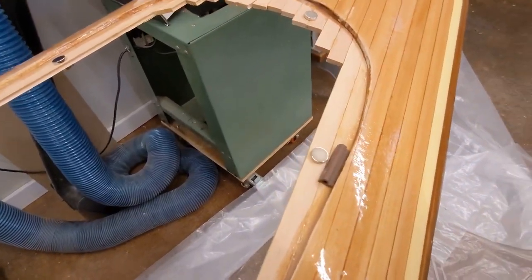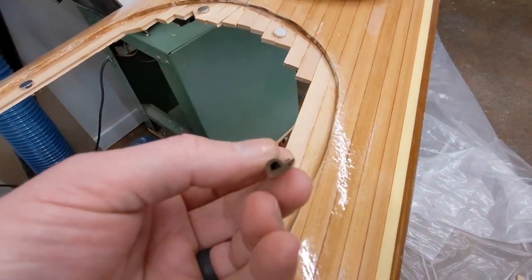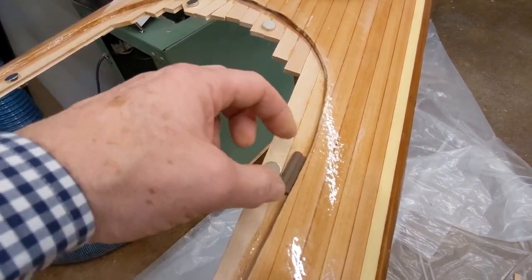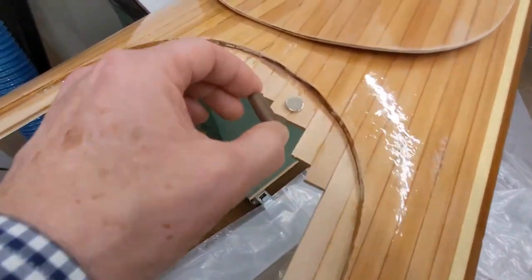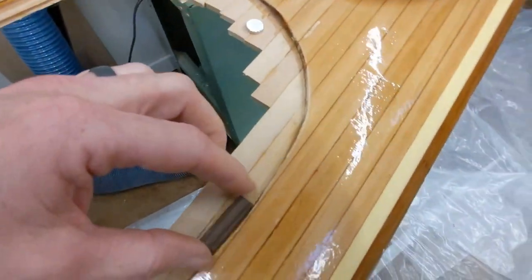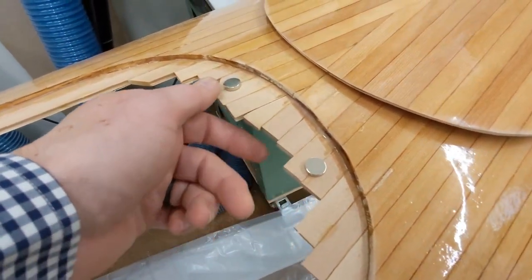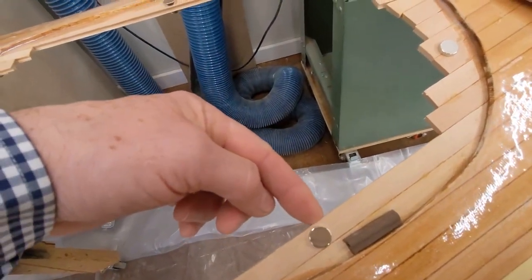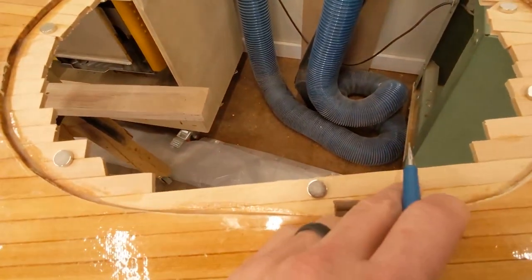So kind of what I did is I just went around and I spaced them all. This is my gasket material I'm using right here. It's like a 3/8 compressed. It's an 1/8 inch thick, but 3/8 inch wide. So I got these all spaced 3/8 off here, so as I go around, they all fit. And that's all well and good, but I'm not going to have enough material all the way around here to do that, and I don't know if I want to leave the wood out quite this far. I think what I'd like to do is kind of take this out of the way.